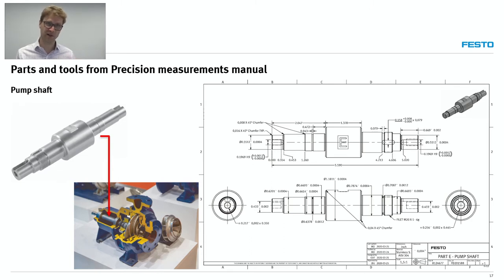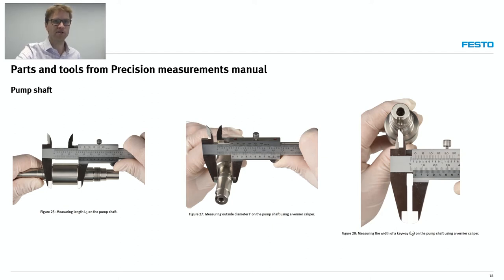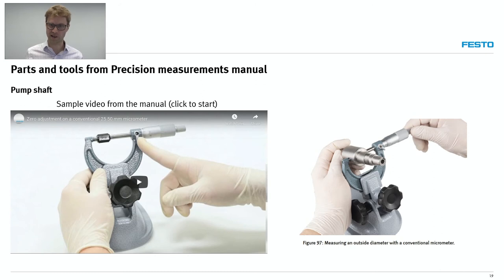The first precision part is a pump shaft that looks and feels exactly like a pump shaft you would find in industry — an application students can relate to. Multiple measurements have to be taken, and on the drawing you'll see we introduce the concept of tolerances. This is the range within which we consider a measurement to be good; if it's not within that range, the part may not be compliant. Students will use the vernier caliper to measure diameters, length, and the width of a keyway, using the instruments in multiple ways.